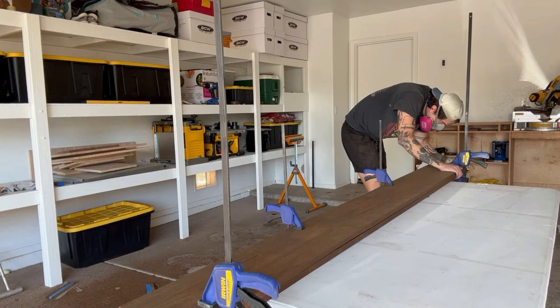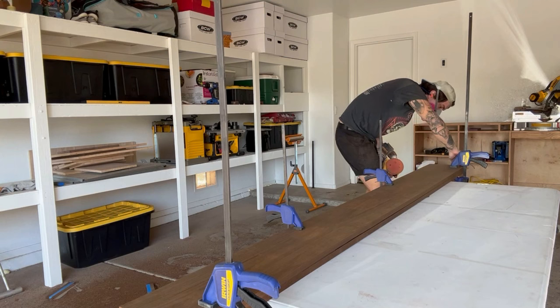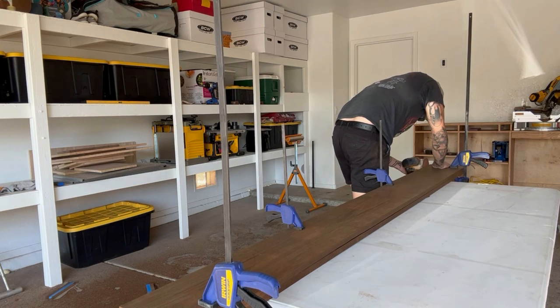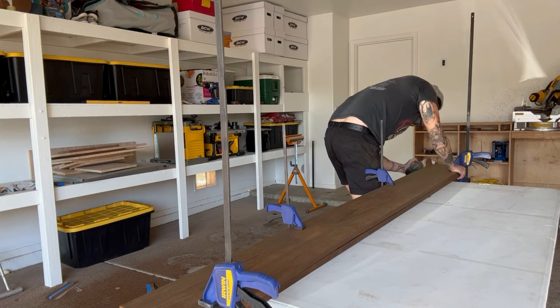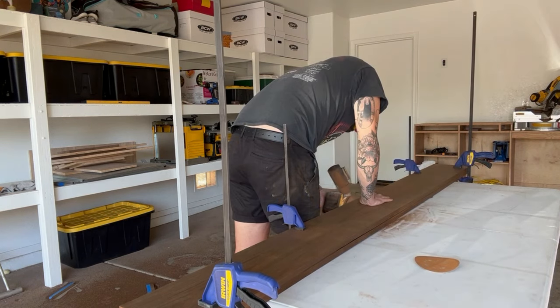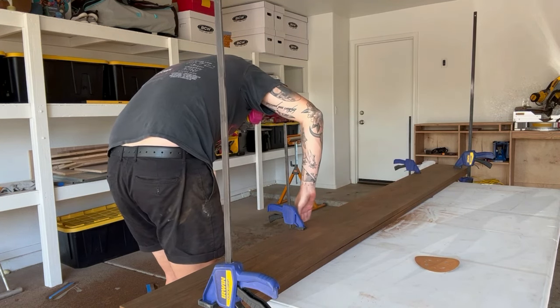Earlier when talking about milling up the lumber, like I said, I don't really care that they're not perfectly square, because I'm not gluing up anything here. I just need them to be nice and smooth on all four surfaces — good enough to work with — but what's most important is that they need to be the same profile. Now that I've got them milled to the proper dimensions, I clamped one on top of the other, and they lined up very closely, but there were a couple of instances where one might overhang the other and vice versa.